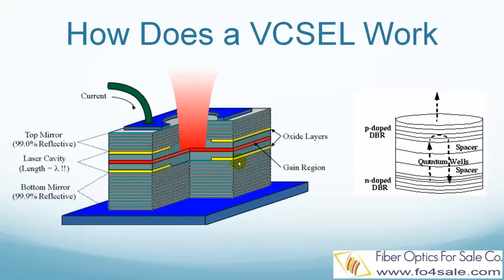Then another oxide layer to confine the light. Last is the bottom DBR layer — the bottom mirror — which has 99.9% reflectivity. Notice that this reflectivity is much higher than the top mirror, so that the lasing light will get out from the top mirror instead of the bottom. The right picture shows how the lasing really happens. The quantum wells generate photons, which get bounced back and forth between the top DBR mirror and the bottom DBR mirror. This is a typical lasing mechanism as in all lasers.